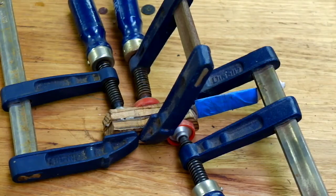Okay, well here it is, all handles glued up. After heat treating, I tried to temper it with a blowtorch — I don't know how successful I was; it did go a nice straw colour but I think I might have overdone it on bits of it. I've now put an edge on it, sharpened it, polished it, and glued the handles on. The only glue I had was 5-minute Araldite and that stuff is a bitch to work with — if you're not super quick it causes problems. If it works I'll be surprised and quite happy actually. We'll come back when the glue is dry.